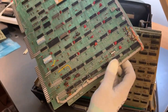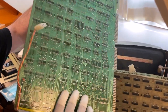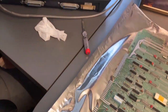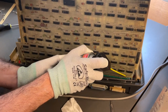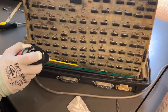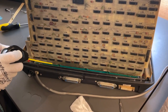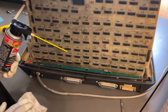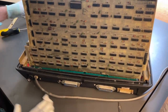Finally, this first card is the I/O card — it produces the video signal; you can see the connector that goes into the monitor assembly. This next card is the CPU, the central processing unit. It's made up of 113 discrete TTL chips. There is one ROM as well in there. This is the heart of the computer — it implements the renowned Wang instruction set architecture.